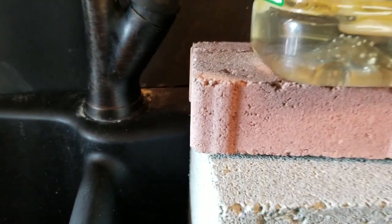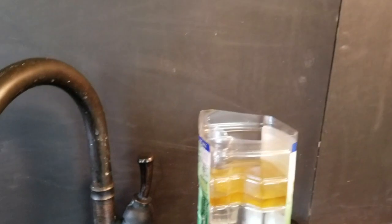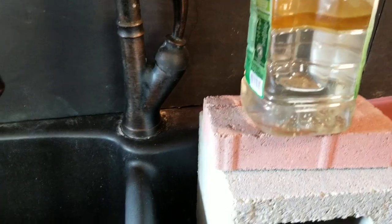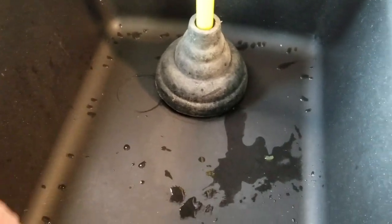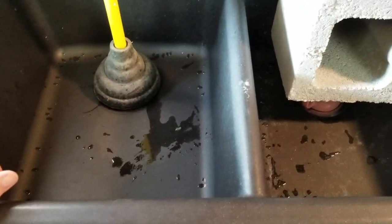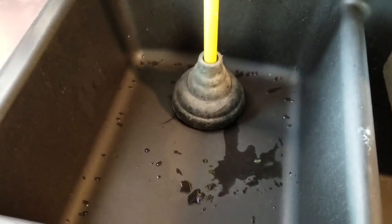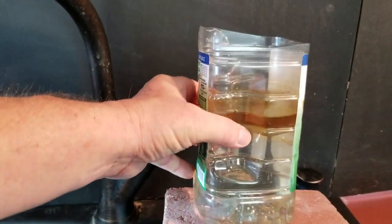Look at that — it's just gone. Right there, see — it just melted away. It's fluid now. It has flowed. We got it hot, and I just poured boiling water on it. That was just grease from a few hamburgers, and now it'll flow right down through there. Your sink will clean out right now. I was just on the verge of calling a plumber and shelling out maybe $300. Fill your sink with just hot, hot, hot water, then start plunging. You might have to go 30, 40 times, but pretty soon it'll clear out just like that — and you'll save yourself $300.